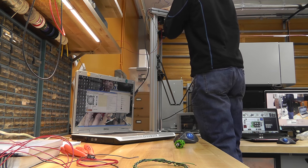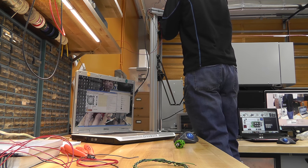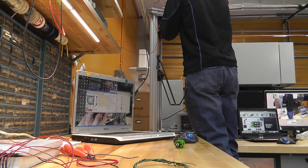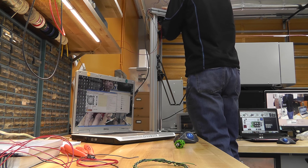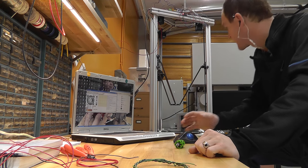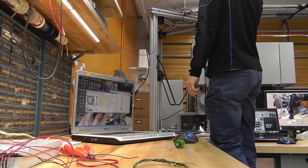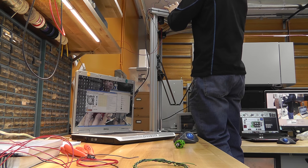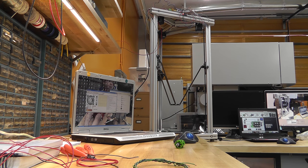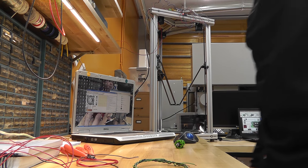So just check the stepper motor drivers. Well, that's the Z. So the one I'm playing with is the Z. So the X and the Y are not functioning. I won't really check the drivers, that'll just check the motors. I'm not too concerned about the motors, I believe they're working. Let's do some software configuration checks and see what we got.